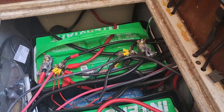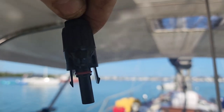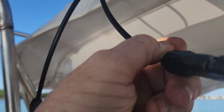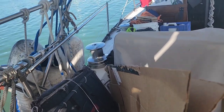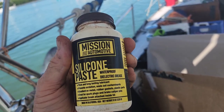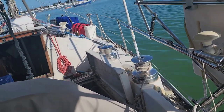The new solar panels have much larger wires to carry more amperage, so let's get this cleaned up and start running the new wires. Now to wire up the new panels, the connectors are weatherproof with O-ring seals, but we still lube them up with dielectric silicone grease to seal out any moisture. This is great stuff — it's not real expensive, available at the auto parts store. It'll keep saltwater out and keep these connections from being an issue.